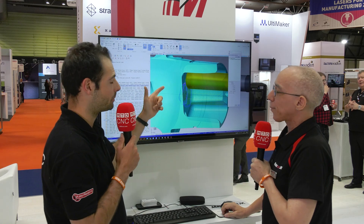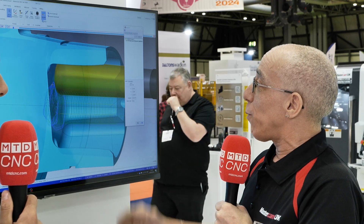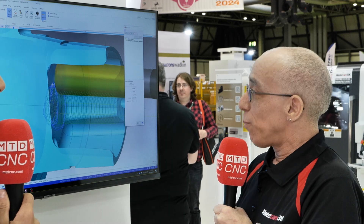With the result of this, as well as being more productive, you're using a lot of the carbide. In the traditional way, you're only using the tip of the tool — that's the bit that gets worn out first, and then it goes for a re-grind. It's never the same again. So we're absolutely getting better utilization of the tool. It lasts longer, higher material removal rates — it's generally a win-win.